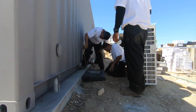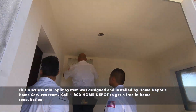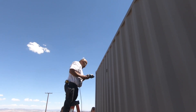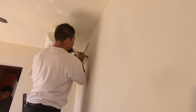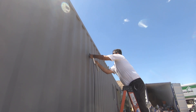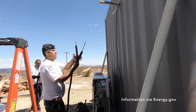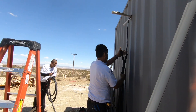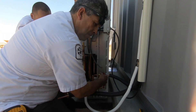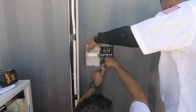The design and installation was handled by Home Depot's Home Services team. They sent a team out first to measure the spaces, find good installation locations, and check the insulation so they could appropriately select components. The installation team worked really fast and installed the whole setup for the whole property in just one day. The only things that pass through the wall from inside to outside are some electrical wires, a hose to get rid of condensation, and a couple of thin insulated copper tubes for the working fluid. Mini-splits have no ducts, so they avoid energy losses associated with ductwork — duct losses can account for more than 30 percent of energy consumption for space conditioning, especially if the ducts are in an unconditioned space such as an attic.